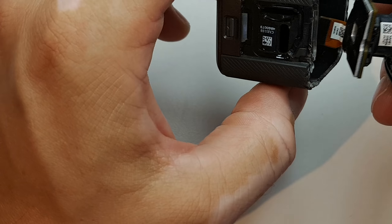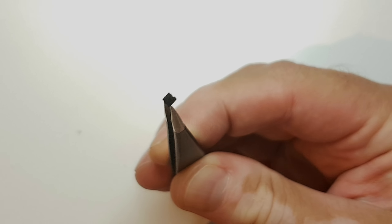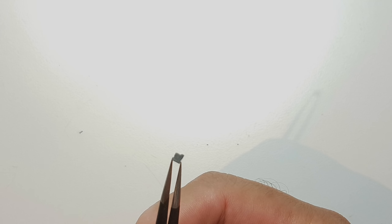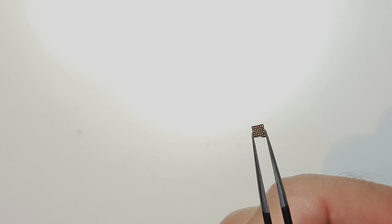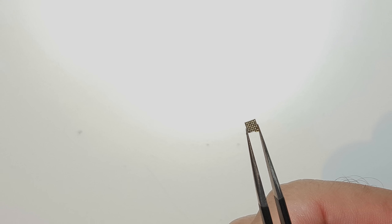Before I start, I want to talk about why I wanted to repair this Session. I had this GoPro and it stopped functioning correctly — it didn't want to start anymore — and that's because of this part. It's broken just like glass, because this part is made out of silicon. Pure silicon, and it's a BGA — that means ball grid array. As you can see, there are very tiny pads on the part. I think it's 2.4 by 2.6 millimeters or something like that, and it has 35 pads.